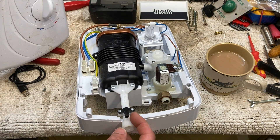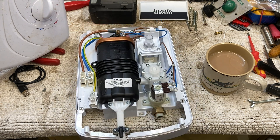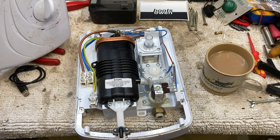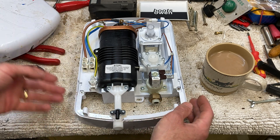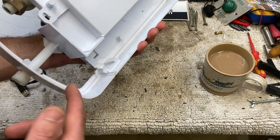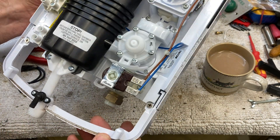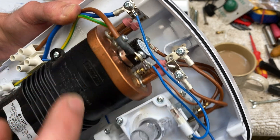The other thing I didn't mention: this little black fellow here has a little diaphragm in there, so if the shower head gets blocked, this will shoot out and override, releasing what could be very hot water — but it should be directed down into the shower basin. And the last bit: there are two screws here and here to remove this fascia for installation, because you can bring the water in from above and down or within any space. Presumably up from above or up from below as well if you cut a notch — there's a notch prepared there for cutting directly under the inlet. All these showers are a little bit different. The fixing points and mounting points are pristine — it wasn't even ripped off the wall.